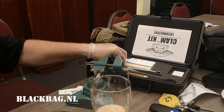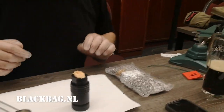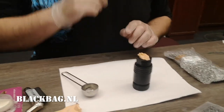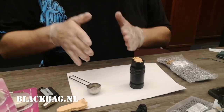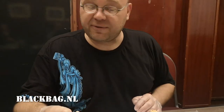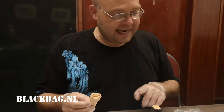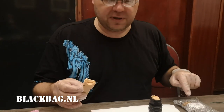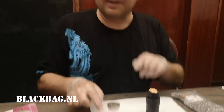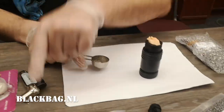We're going to try the rose metal first to figure out if that actually works. To cut down on variables, in the first stage we're going to use the molds that we made two weeks ago to cast a key with the rose metal. So if that works, we know the rose metal works, and then we'll move on to something else for the cast-making material.